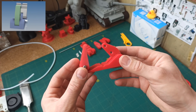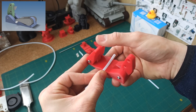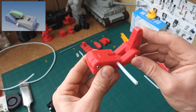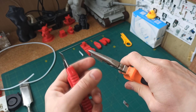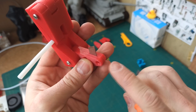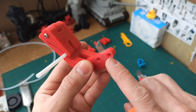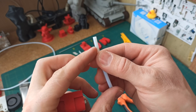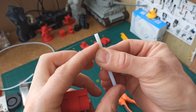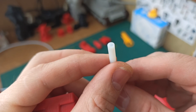In my opinion it's a very interesting design. It has a special clamp needed to hold the teflon tube tightly, which aligns the tube in the plane, and also a special cutting lever. A regular stationery knife blade is inserted here — you break off a small piece and carefully insert it into the special slot. It is fitted very precisely; if needed, you can tighten it further with M3×10 screws and M3 nuts on the back. We clamp the teflon and carefully cut it to size. The result — a beautiful 90-degree angle, exactly what we needed, with a burr-free surface.